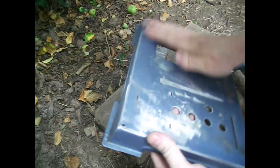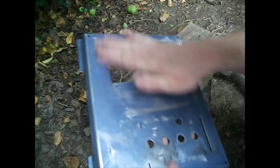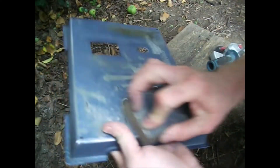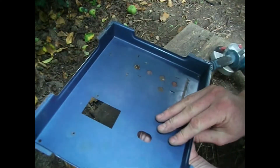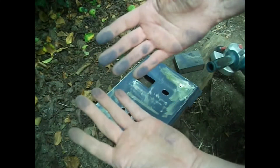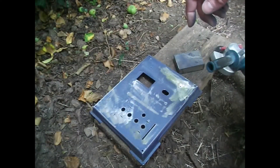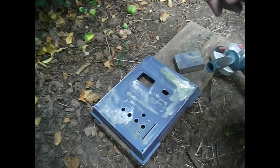No filling required. It's nice and smooth. There's a key on the whole surface now, ready to receive the primer. Back's unaffected. One other very important thing to do — I need to go and wash my hands because, as I say, this could be lead paint. So before I do anything else I'm going to go and do that. Then we'll give this a wipe down with some meths, maybe white spirit, depending on what I've got easily accessible on the shelf, and get on with the primer.